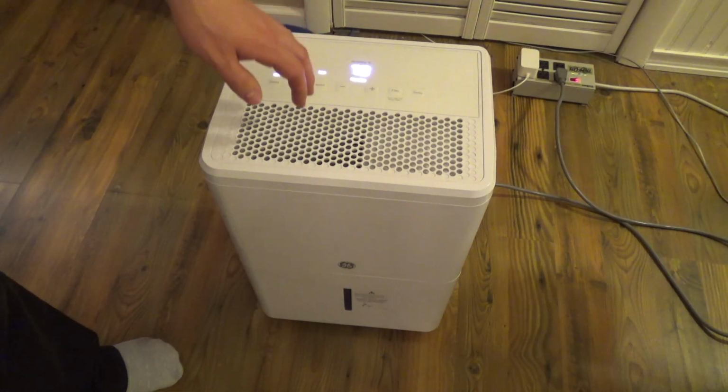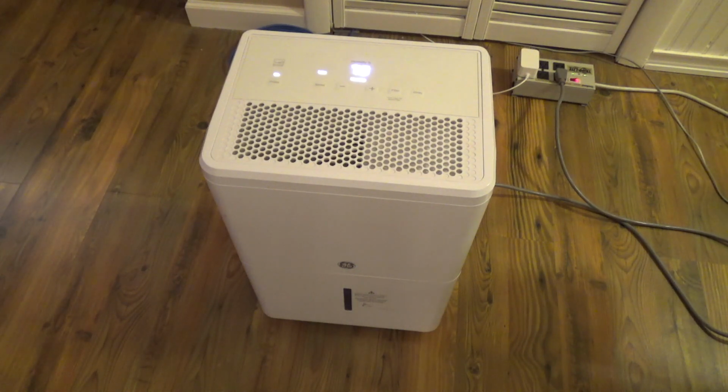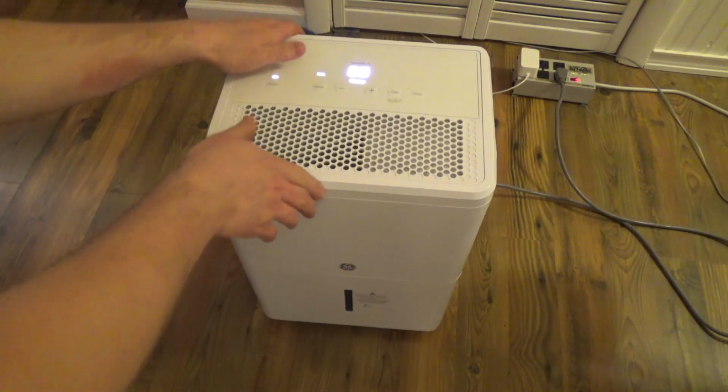Well, it sounds like the compressor is pumping refrigerant, and it's building pressure. Yep, I can hear the compressor coming under load. So it seems like it is still going to have a charge, which is kind of unusual. Usually these things are good for maybe 2 seasons tops.